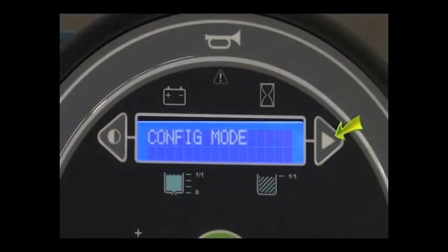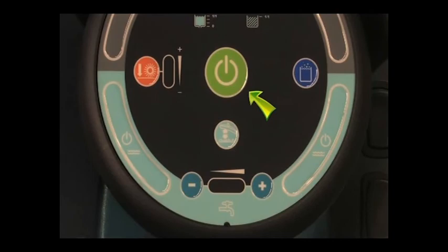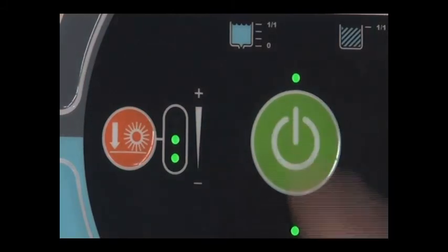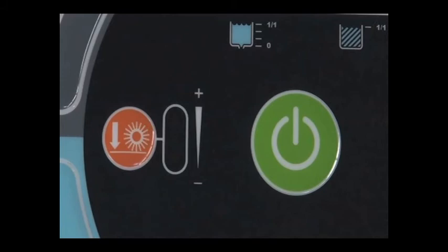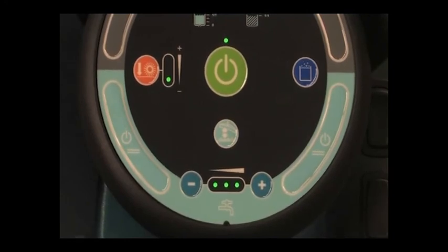The supervisor control button is used to access the configuration and diagnostic modes. Only properly trained service personnel should access these modes. The large green button in the center of the control module is the one-step scrub button. Pressing this button turns on all scrubbing systems that were active the last time the machine was used. Note, there may be a short delay before all scrubbing systems are activated and the indicator light turns on. Pressing the button again turns off all scrubbing systems. When the one-step button is pressed to stop scrubbing, the machine remembers which scrub settings were active, and when pressed again to start scrubbing, the machine will return to those settings. You can raise the rear squeegee and turn off the vacuum fan by pressing the squeegee button, and pressing it again will lower the squeegee and turn on the vacuum fan so you can recover the solution.